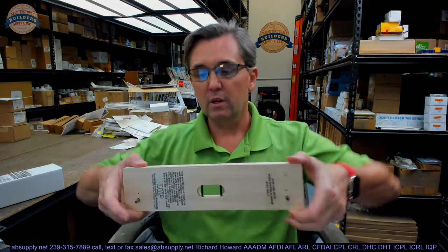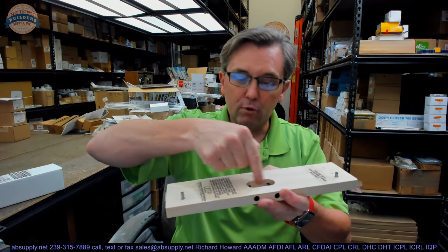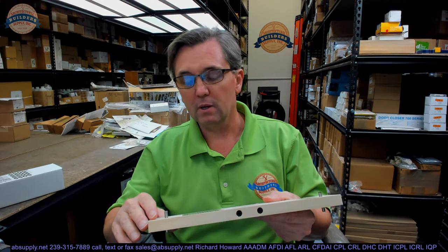The one downside, in my opinion — and I've spent years in a metal shop and a wood shop and done basically every prep — is that the long-term durability means you're not going to get hundreds of doors out of this. As you run the router through here, you'll affect the actual size of the prep. You'll take those screws in and out countless times — that's wear and tear. You'll also run the risk of nicking the template itself, which would ruin it permanently. But they're inexpensive enough that when it wears down, you're good to go.